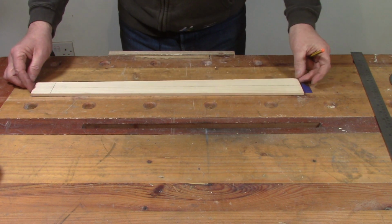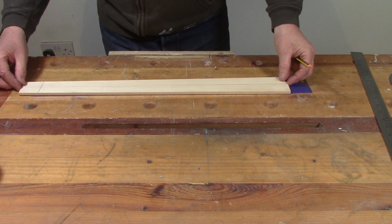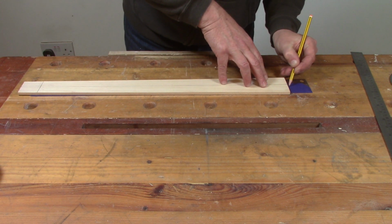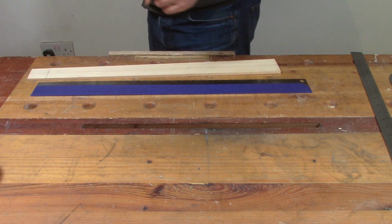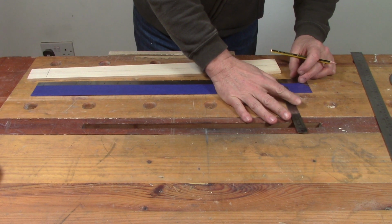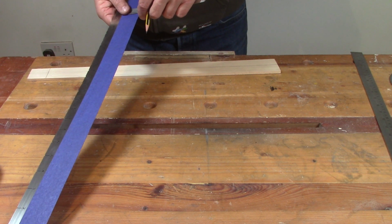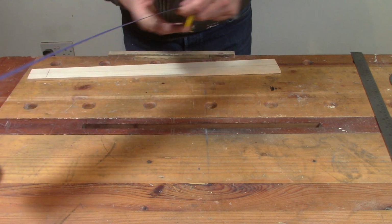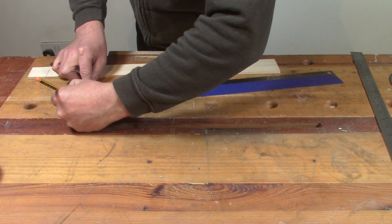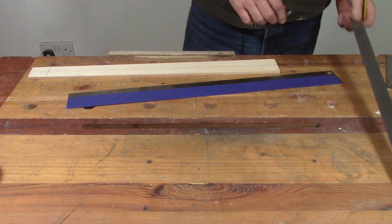So to position this, I basically just need to put it in a position where down the thick end of the fretboard here, it's not obstructing the little notches that work in the jig. And then I'll mark where the centre line is. Measure that to the edge of the template, which is 26mm, and then put another mark up this end, and then draw that line in.